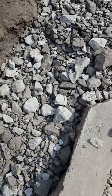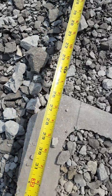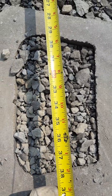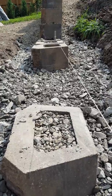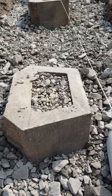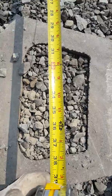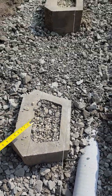So what I did was — let me show you this — before I filled in all this rock to the top of it, I just measured over 25 inches to the next edge. These are 17-inch blocks. So that means that this row here that's up higher will land right in the middle, because I'll be 34 inches — right in the middle of this block, which is good. This is a step-down row. Before I filled in that middle, I'm sitting on top six inches of rock, got my drain tile rock in front, rock in back. Since this string's level, I just measure down eight inches, then bring it out 25 inches from this front edge to the edge of this block, or to the middle — 34 inches. That way, this row here will come down here, and I'll just continue on with this row — that step down steps down one.